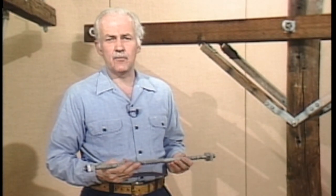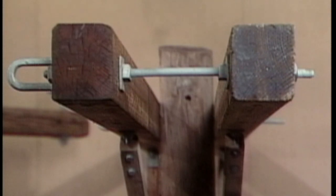Machine bolts aren't the only type of bolts used to frame a pole. For example, double cross arms are usually held together with double arm or DA bolts. DA bolts are generally threaded along their entire length. To hold the cross arms apart, nuts are screwed down the DA bolts so they're inside each cross arm. Nuts on the outside hold the arms tightly against the inner nuts.